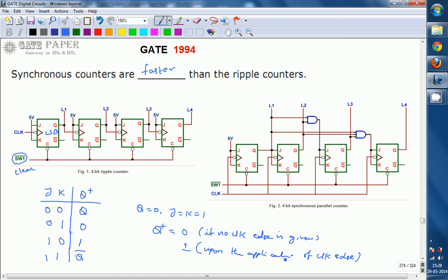If J=1 and K=1 but no clock pulse is applied, the output won't change. That is why J and K are called synchronous inputs — they will always have effect on the output only upon the clock edge, and are always operated with the help of a clock edge.